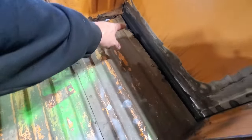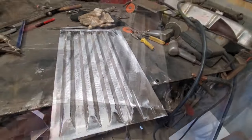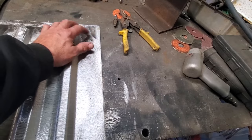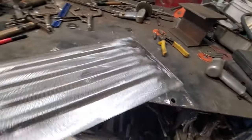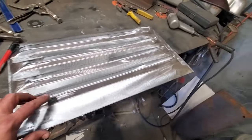So the box gets wider as it gets up there from that setup, right? So I'm going to make the measurements now, transfer them over onto this, mark it and cut it off. So I went ahead and trimmed up the side over here. I cut it off, and it's basically 1/2 inch in the difference between here and here, because there's a taper. Hard to see with the camera, but there is a taper there.